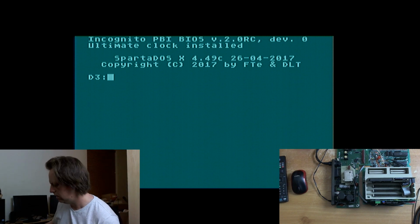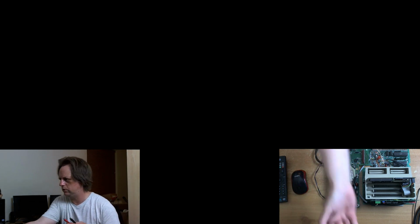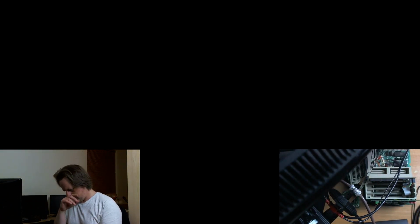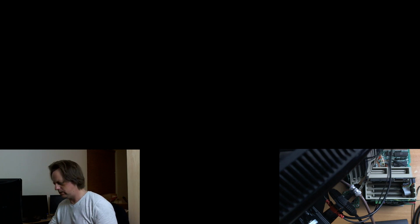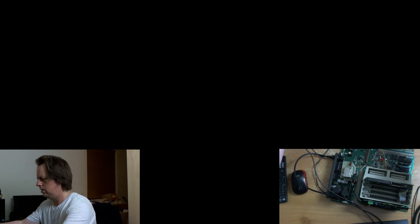Let's have one more look at the... it's definitely a ground thing, no question about it. Have another look. Exactly the same thing happened the first time I installed one of these boards, because that time I'd wired the ground to the wrong pin on the jack. So really, yes, there needs to be a direct path from the ground pin on the jack to the video cable. If we haven't got that, we're going to have problems.